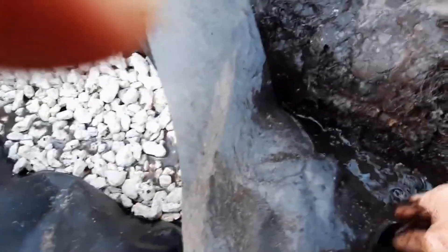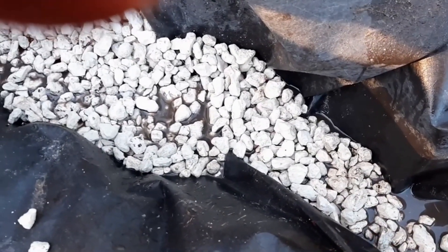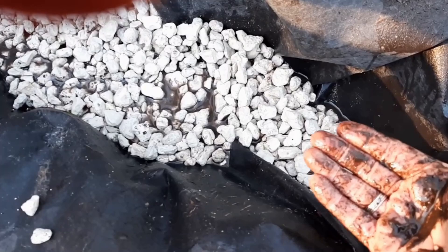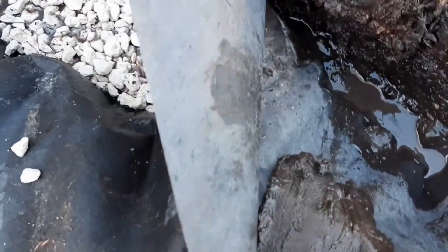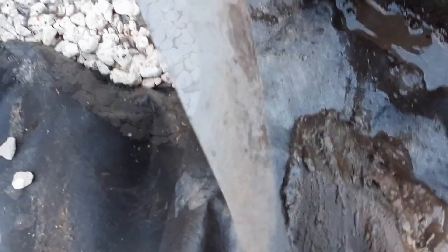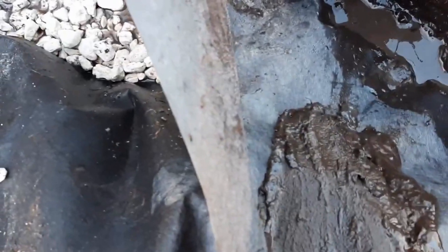Remember, this collects subsurface water — water rising up. Remember the dewatering system? This is groundwater. French drains collect groundwater. As water rises, it enters into the gravel, into the pipe, and is carried away. Perforated pipe sitting at the bottom of a fabric-wrap trench without gravel will not function properly. Mud and silt will pack against that fabric and not allow water to penetrate into your system. The base of gravel really helps that water get into the system, even with this type of poor soil.